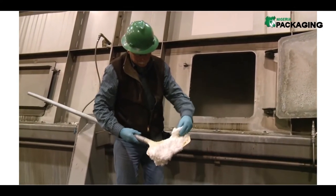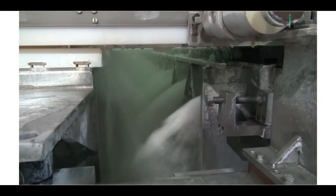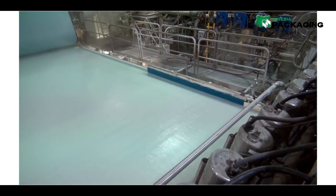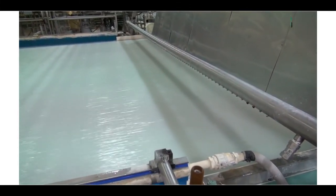Assuring a strong, clean paperboard product begins with delivery of the pulp. Depending on the specific product being manufactured, some chemistry is added to help the paper stand up in a wet environment — things like milk containers or orange juice containers. Starting out at over 99% water, the pulp slurry is sprayed onto a moving mesh screen in multiple layers, creating a mat. This process builds up the layers of pulp fibers, assuring the final strength of the product.